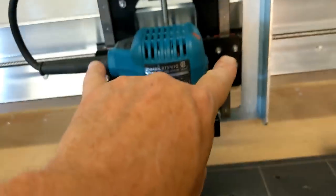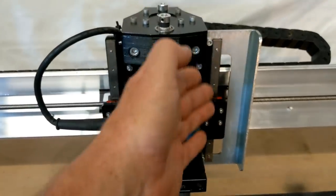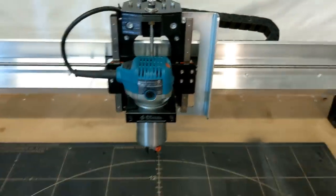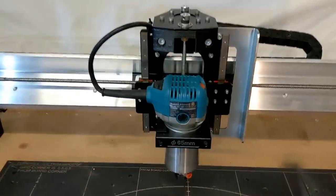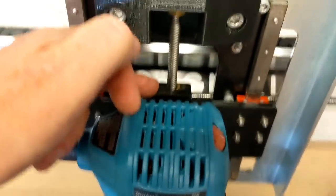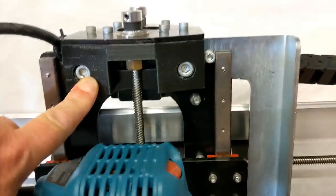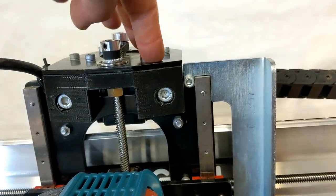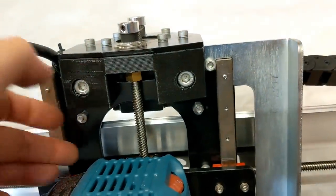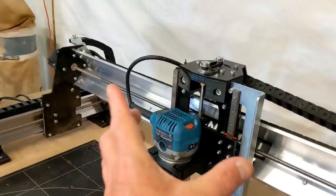The other way that you may see in machines that have the Z rail is they'll use tubes instead of the linear rails. It's kind of six of one, half a dozen of the other. This is very common in the majority of CNC routers in this class, and they work quite well. So as I explained before, there's a nut right there, and then that goes up and comes up here. Now there is a plastic component here that this upper bracket mounts to, and a plastic component is bolted into the X-axis gantry carriage. That's actually what this whole assembly is called, a carriage.